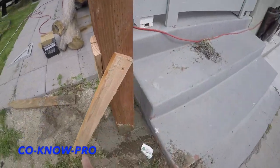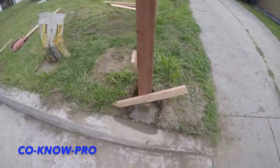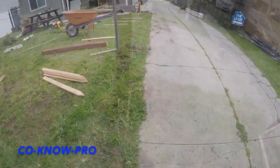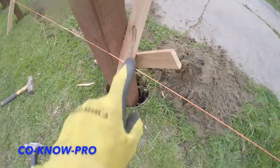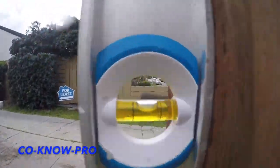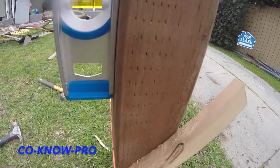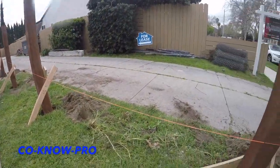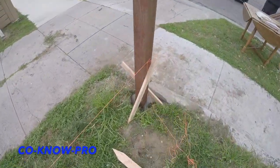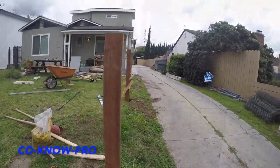I set my first post and set all four corners — I dig the hole, set the post in concrete, and set all four corners. That way I can pull my dry line, which is right there, and basically have my total perimeter mapped out. Then I do my layout on the dry line using a little marker. Make sure all your posts are level and secure and really set in concrete well. After you have your layout, those three lines right there show my layout for my next post — I have a center mark and my outside and inside lines.